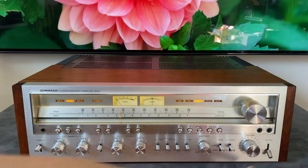Now, if you do see that they're black, they're likely still the originals, which are almost always Nichicon or United Chemi-Con. These are rated at 22,000 microfarads. And what I want to touch on is that if they're still the original can, I think the blue ones are slightly taller. But if you see the original black ones, it's not necessarily a disqualifier. Oftentimes, these will test very close to the original capacitance value and low leakage. So these are okay to stay in a lot of times.